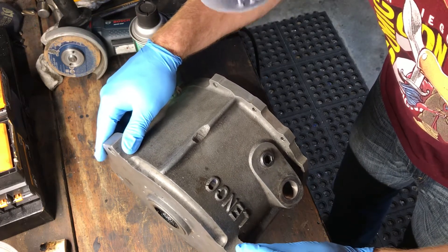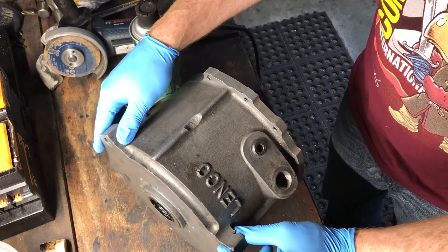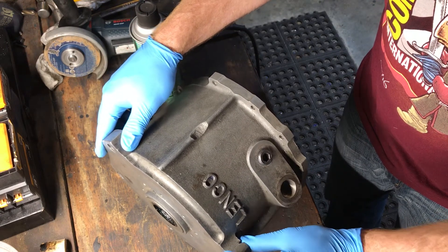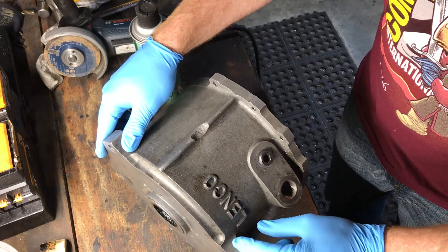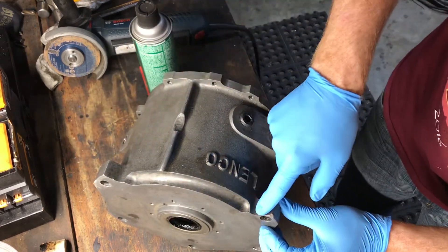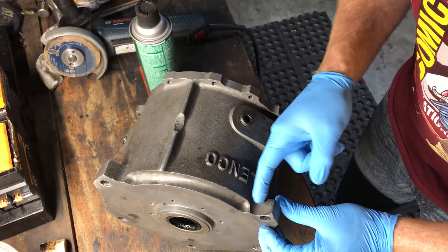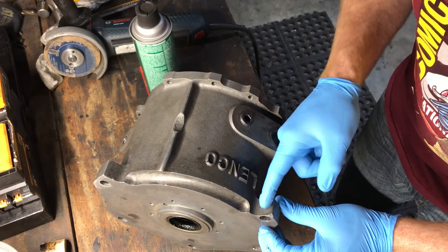You can probably see the crack here. What I'll be doing is getting a bolt and putting it in there, then welding up and building that up with some material until it's a lot thicker than just that thin section there. I'll probably have to go all the way along the end and then build it up next to it and just fill it in as much as I can.